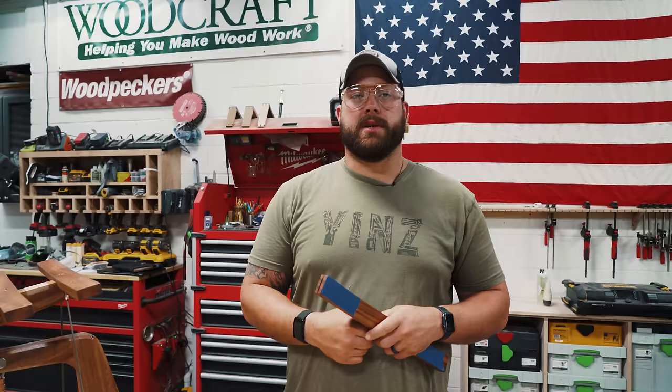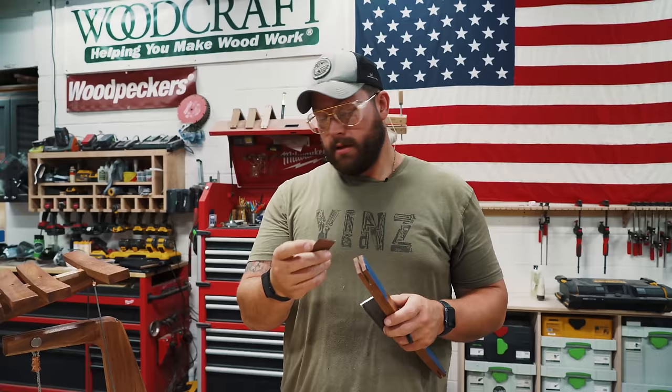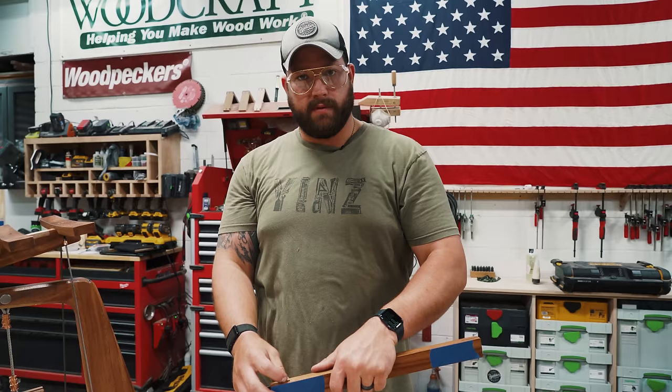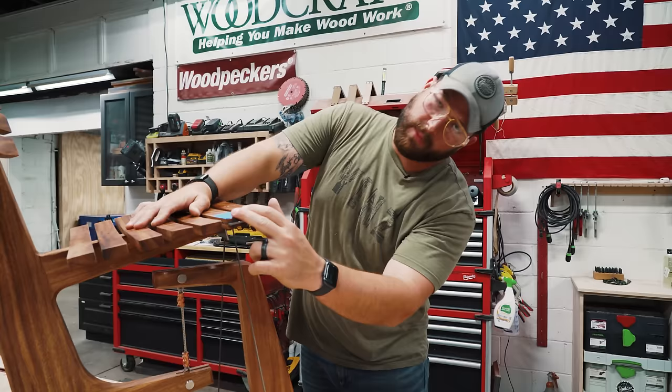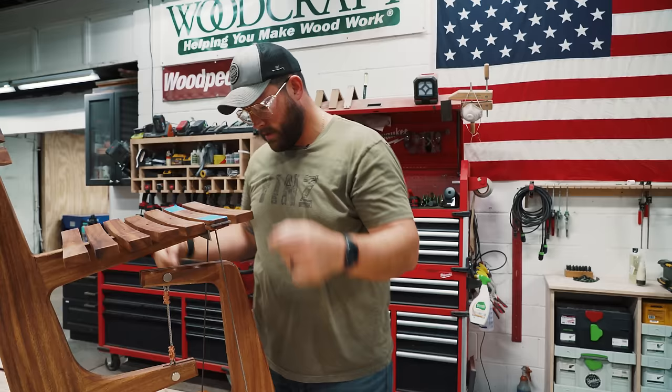What I'm doing here is creating some reinforcement. One piece is going to go into the edge here and that's going to create reinforcement for what's pulling down — because if I just countersunk and pulled a thread through here I'd only have about a quarter to three eighths of an inch, which would rip through the wood. This interior part is going to act as a support spline against our center line. We'll cut that to be a little prettier and then put some holes through here and run another cable down to see if that helps with the side-to-side sway.